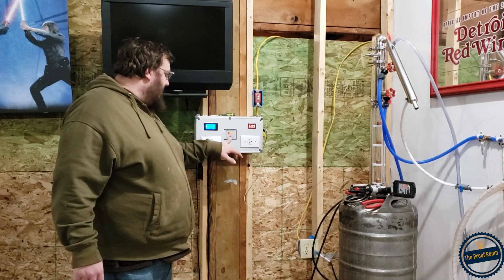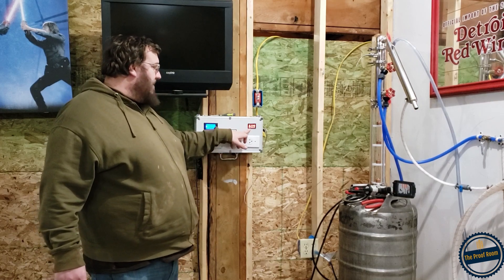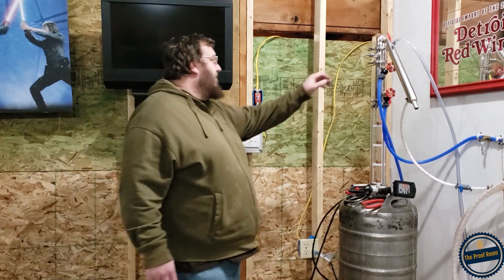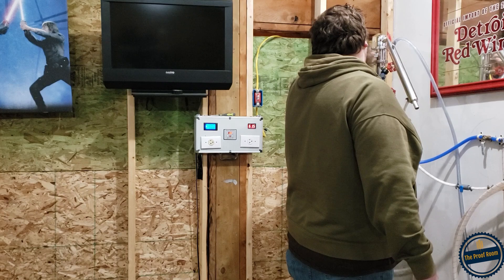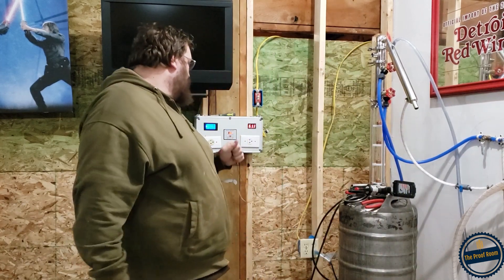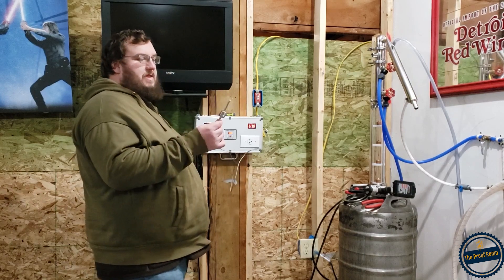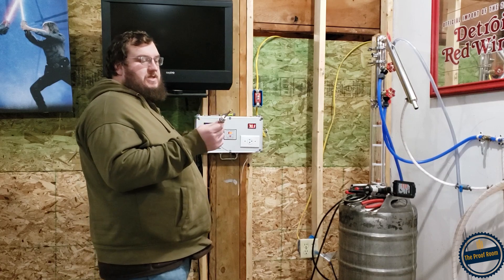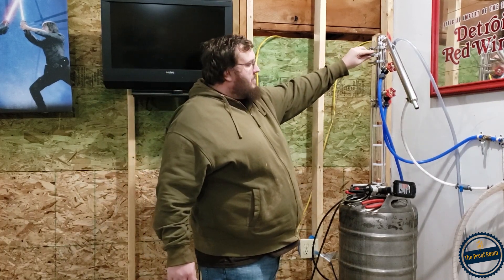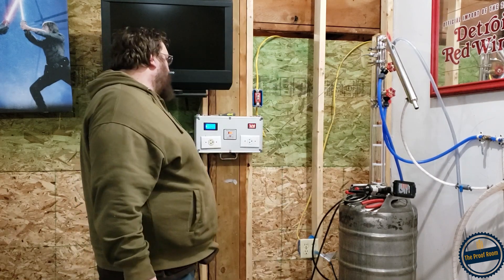Let's turn everything on here. This does have a power on and off, so it does control one of my elements just with this button, and my temp gauge looks like it's reading fine — 61.2. Temperature's going up. This is one of the only things I would suggest you upgrade to: this is just a half inch NPT thermometer probe and it goes directly in here and screws in, so you don't have to fuss with drilling a hole in your column for the standard one that comes with this.